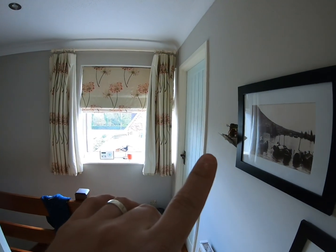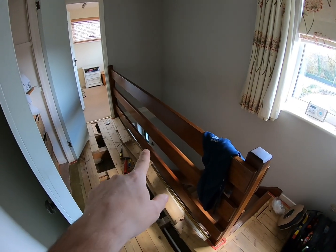Hi, good afternoon, welcome back to the channel. Got a little job this afternoon — worked at this house before. This client has got a two-way switch between this point and downstairs, and when we came to put a new board in a little while ago, we found they had a shared neutral for both lighting circuits, which caused an issue because it's a split load board and you want to divide the light circuits between the two RCDs. There were two borrowed neutrals from the downstairs to upstairs lighting circuits.